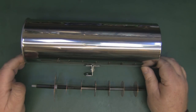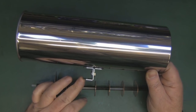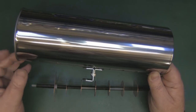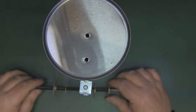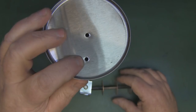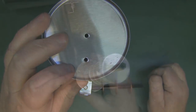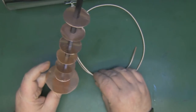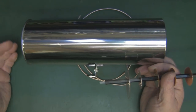Now ready to put everything together. The can is prepared — I've attached a mount so a tripod can connect to it, and I'll link to my cantenna video for those details. I've drilled a hole dead center in the back of the can — this serves as the back reflector — and a separate hole to feed the coax through to an SMA connector. I've got a length of coax slightly longer than needed, which I'll feed through the can and trim the excess.